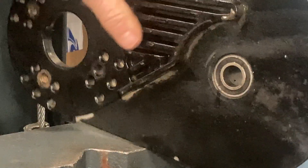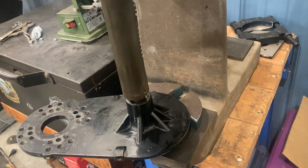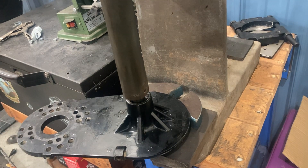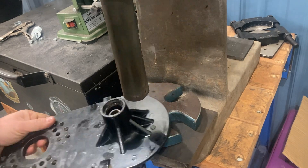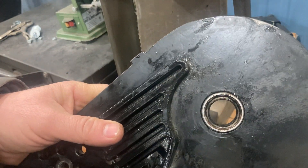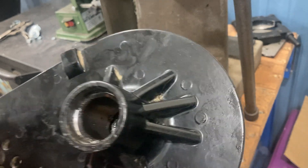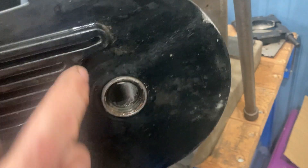Having a lot harder time with this one — partly because it's bouncing since it isn't sitting flat. I moved it and it still doesn't want to come out. Instead of using heat with the punch, I brought it over to the vise and I'm using a wrist pin from a Ford 300 straight-six to punch it out since that's a pretty good size. That broke the inner race off and started to remove the outer race. It's gonna be a bit of a pain — we're going to have to go back to the punch to contact the inner race and heat it up after all.